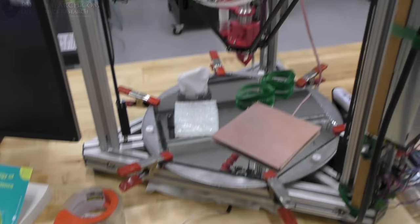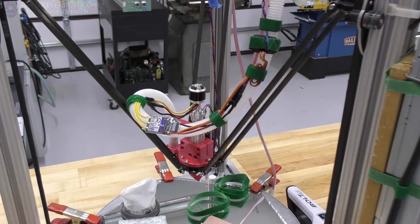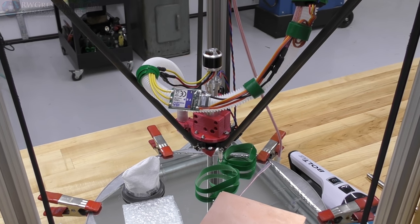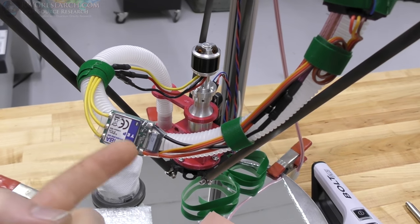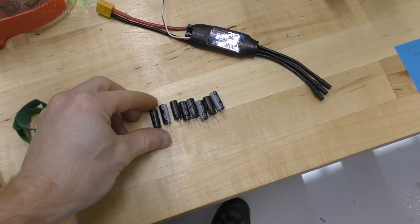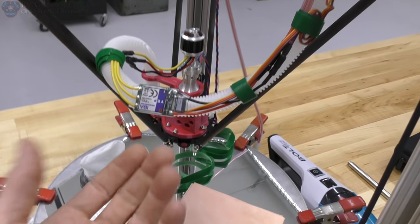But I would think you'd actually use high voltage suppression capacitors, the Mylar type or something similar. Maybe not Mylar, but whatever they are made out of, some ceramic or whatever. But it's kind of weird to me that they use this type of capacitor, which is an electrolytic capacitor. But whatever. They're experts. They designed this circuit. This is what they specify.